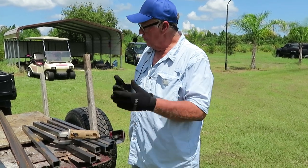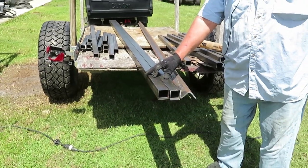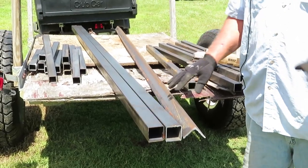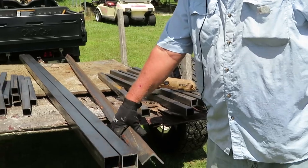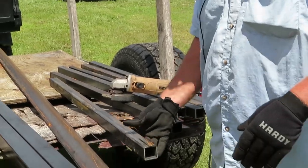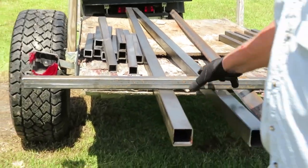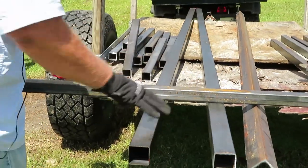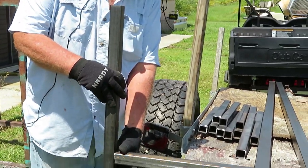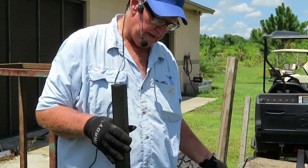To build the trailer, we're taking two 2x2s, 10 feet long, because I'm going to make the trailer 10 feet. That's going to be the main beams which are welded to the axle. Next, these are the cross sections - they go on the main beam like that. Here are the two main beams, and then the side pieces are going to be welded on here on both sides. We're going to have a total of 6 major pieces, so it's like 2 feet apart.